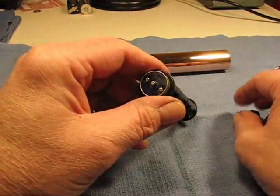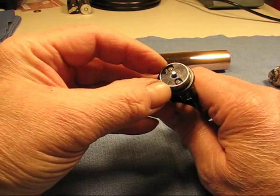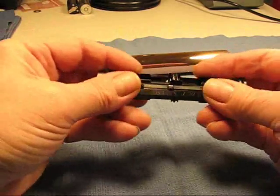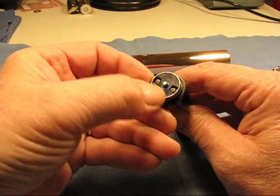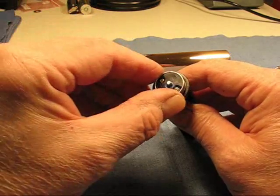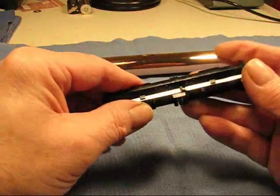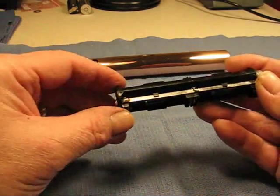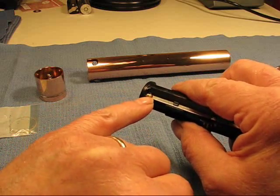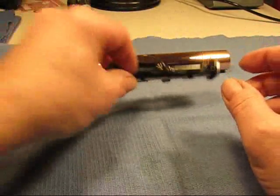The different thing about this Dorsey is the positive pin is up top where you'd expect, but the negative ring is also up top — that's not going to work for me. The nice thing about these Dorsey holders, besides being a very well-made holder, is that the whole contact plate is screwed in. I removed the two screws, rotated the contact plate 180 degrees, screwed it back in, and now that top contact is no longer negative. The negative rail goes all the way down to the other end, so I made a copper cap for the negative post and soldered a wire right into that negative rail. Now I have negative at the bottom and positive up top, and it'll work great inside that copper pipe.